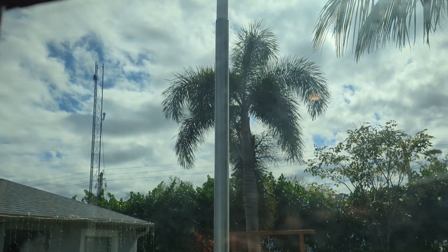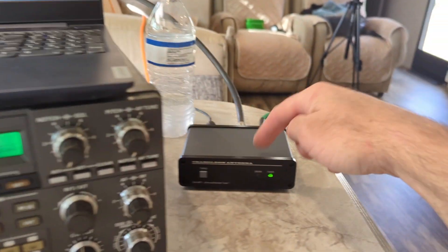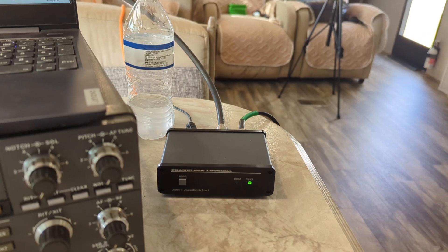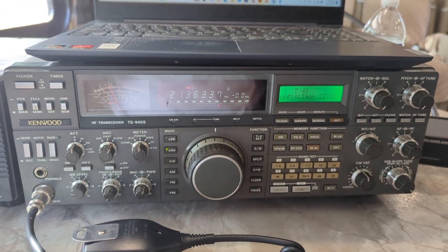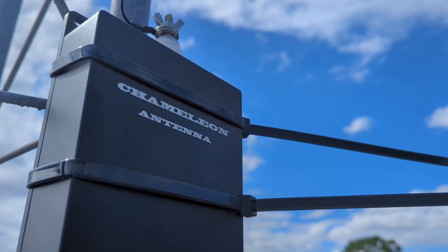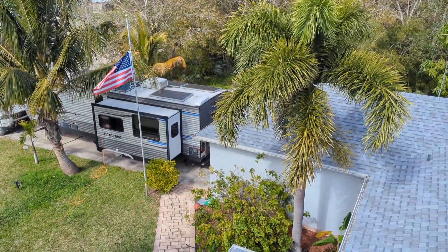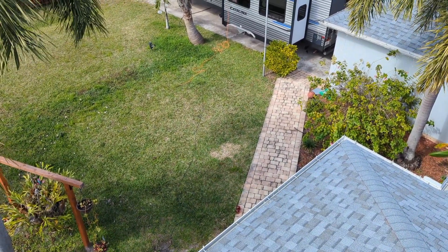It's a universal remote tuner. The tuner's up top, and I'm going to show you what I have for an antenna and why I picked it. This control box is sending voltage over the feed line — over 100-something feet of feed line on 190-foot random wires. Here's the other side of the Chameleon CHA URT-1, the universal remote tuner. The RV's down there, about 100-something feet of feed line.